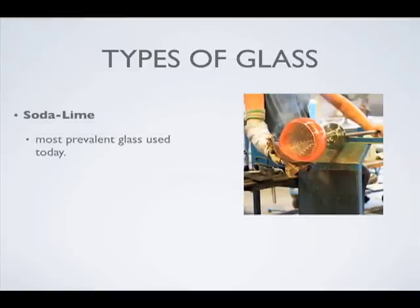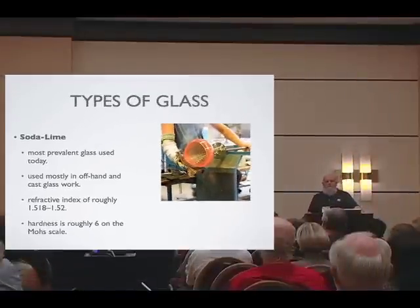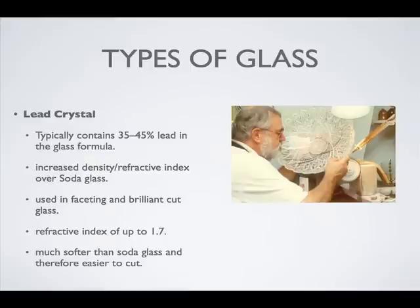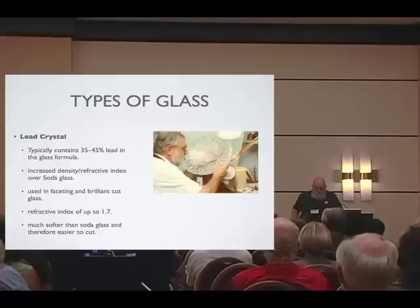All of it needs to be worked. Working with different kinds of glass: offhand glass blowing uses a soda lime glass, which is average in hardness and polishes generally pretty nicely. Then we have lead crystal — whether it's decorative cutting, casting, or polishing, there's always debate over whether lead glass is easier or harder to polish. For some it's easier, for some it's harder. The major difference is it's soft, so it scratches really easy. Soft glass polishes easier, but it's a little more fuzzy.